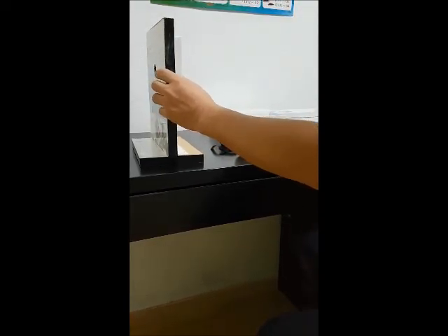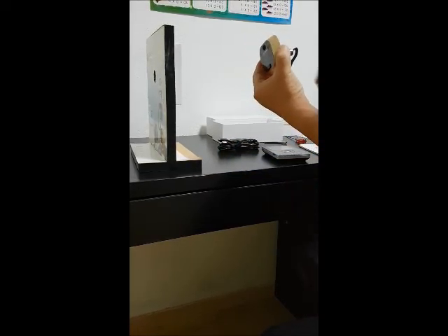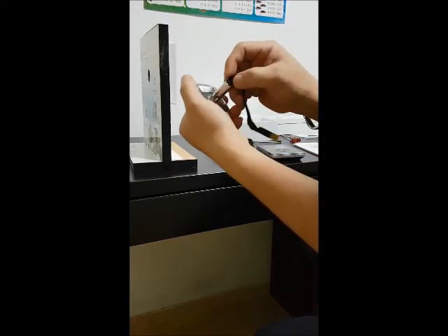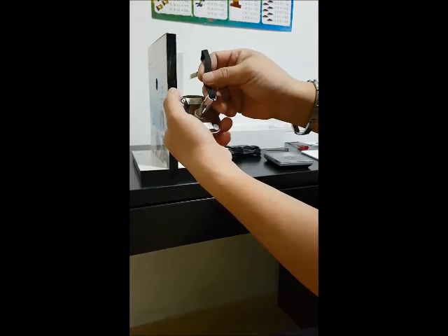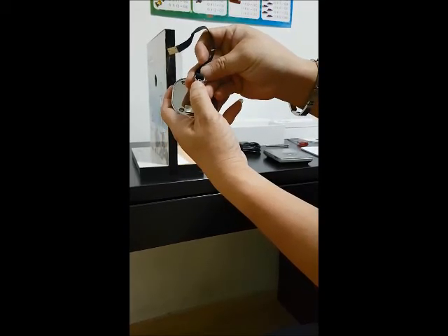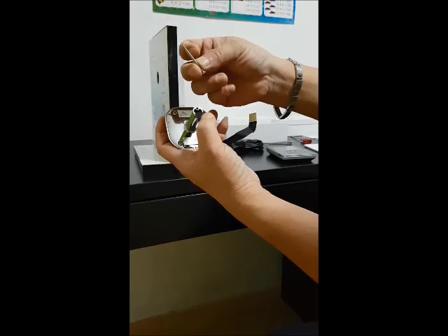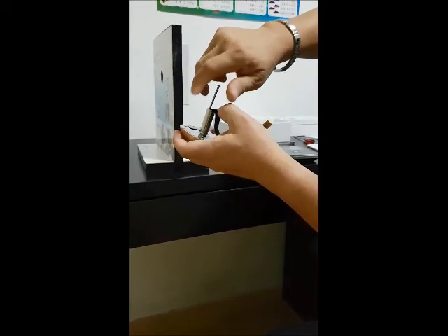For this door, it is merely 40mm, so we only need to use the 2 short ones. Let's begin the installation. First, we use the front door viewer. You can see there are 2 little tiny holes here, in between the side of this cable — one here and one here. Bring your 2 short screws and screw them in as much as you can.